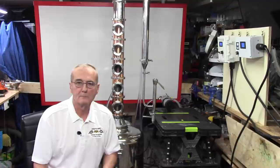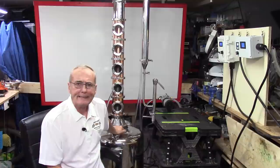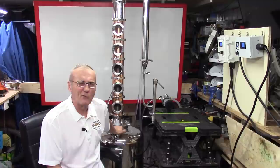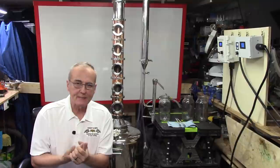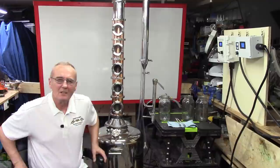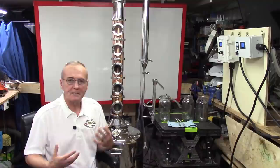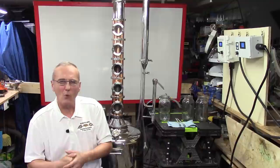We'll be back shortly because I'm gonna let this thing heat up. With 7 kilowatts and 21 gallons I'm thinking probably 40 minutes, we'll find out. Update: it's been 17 minutes and we're now just shy of 150°F, which is about 62°C in the kettle itself. I can already see that my bottom sight glass is starting to fog up, which means I'm developing a little bit of vapor.